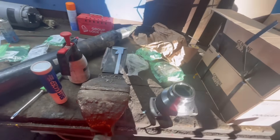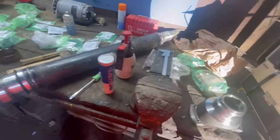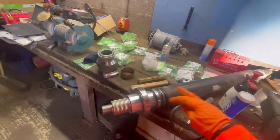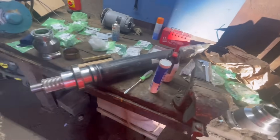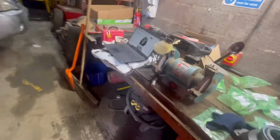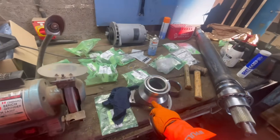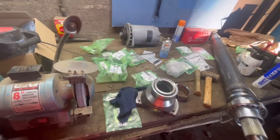The outside diameter of this is 102 and the inside diameter of this is 100, so no amount of brute force with a hammer is going to make that fit. We're going to have to get these yokes turned down on the lathe. Both ends are the same. These yokes came with the shaft rather than from Doosan, so a bit of a pothole, but we'll overcome it.